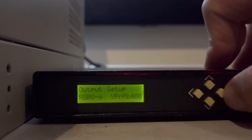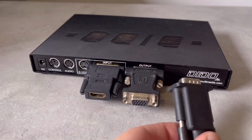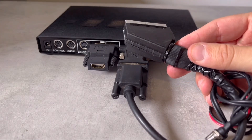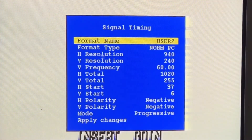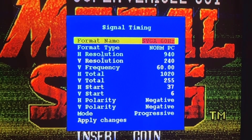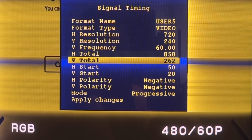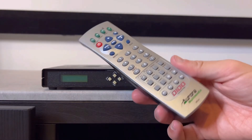Component video will only output starting from 480p. Without an RGB-S output, I'm using the tried-and-true passively combined HV sync circuit, built into a male SCART head. 240p timings are programmable into the user presets, and although there are 10 that you can alter, only 5 will show in the resolution menu. Entering the signal timing menu can only be done while displaying any of the stock resolutions. The remote isn't required, but it made programming and calling up presets that much easier.